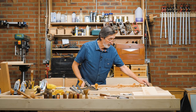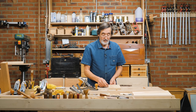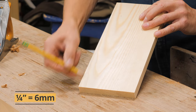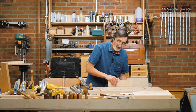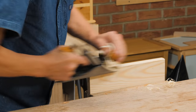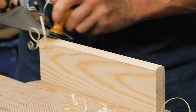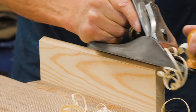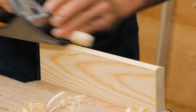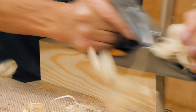Now we're working with rough wood, but what about smooth wood? What if you had to take off a lot of material — say a quarter of an inch from the edge? Take the plane and tilt it down to that quarter-inch line. It's hogging off that material. Do the same on the opposite side. At first it feels like it's taking nothing off, but work down to your line. You'll have a ridge in the middle — then take off that mid-section. This works across a wide board using exactly the same technique.